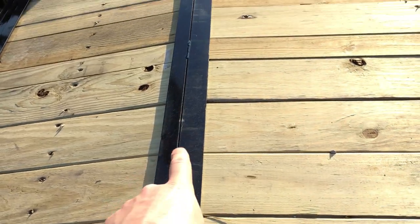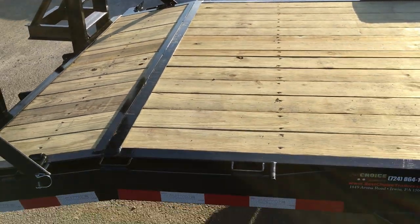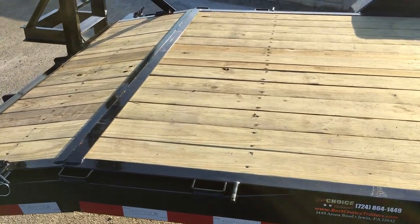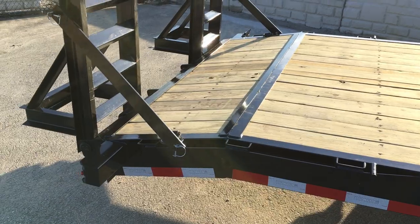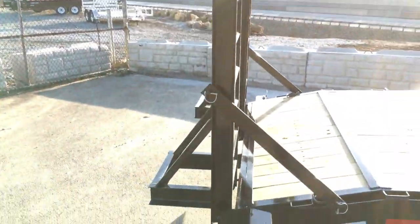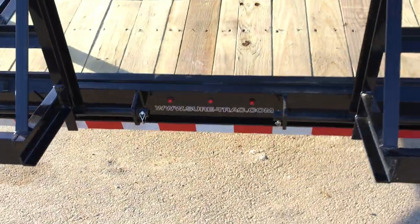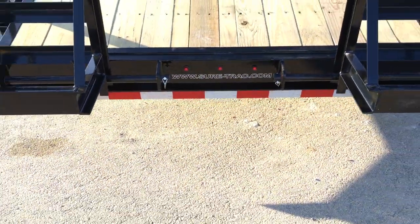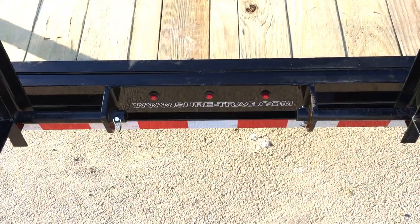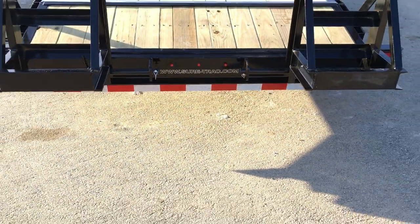Notice that the transition piece is also a welded-on piece. Some leave the wood butted against the wood, but a nicer way of doing things is your transition plate. As we said earlier, instead of a three-inch channel ramp, these are going to have a four-inch channel. You've got about 16 to 18 inches between the ramps — they won't go all the way together — because of your LED lights at the back, your bullet LED marker lights.